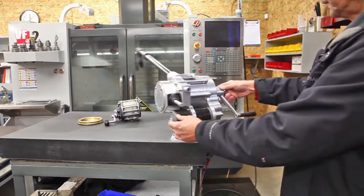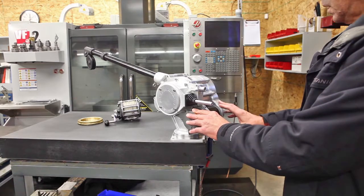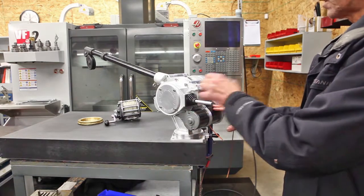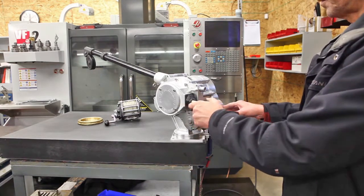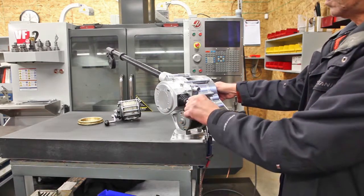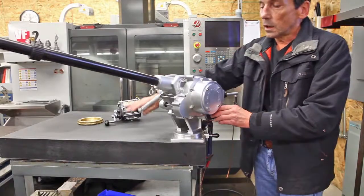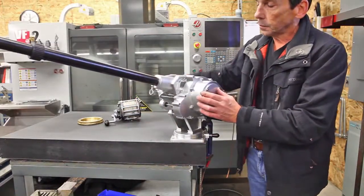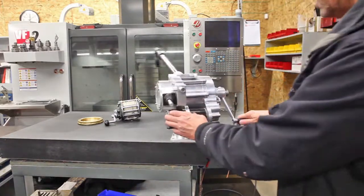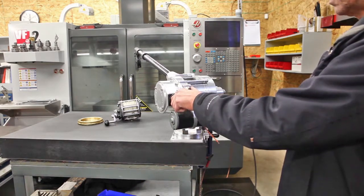In the electric drive, you disconnect the handle and switch power on, or you can leave the motor running and switch through the gear ranges at any time. It will shift while the motor's running. If, for whatever reason, you run out of power and you want the 20-to-1, you just switch into electric drive mode and you have full function of the gear range. And as you can see, the spooling gear functions and you have full swivel. And that's in case the power fails and you just need that extra 20-to-1 ratio.